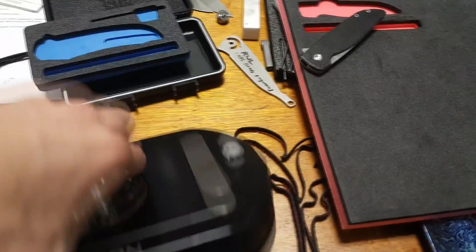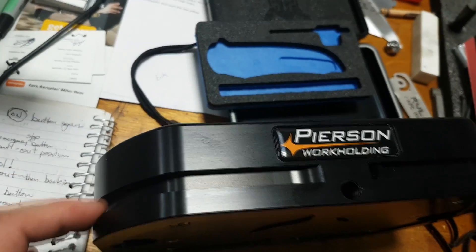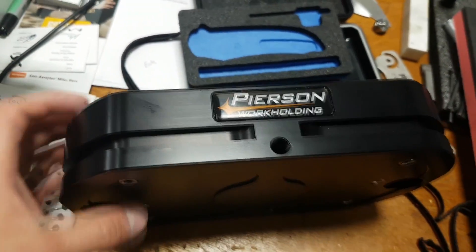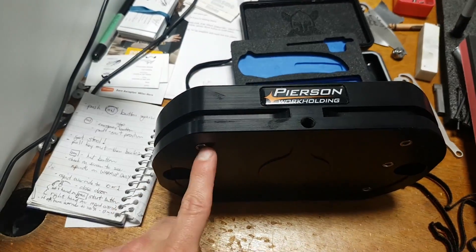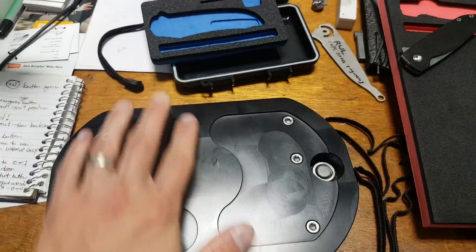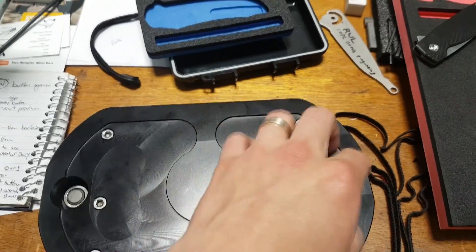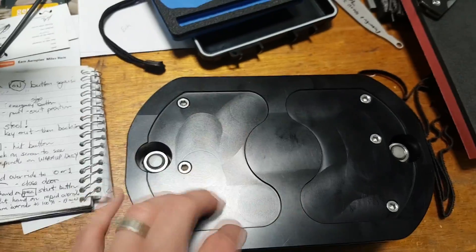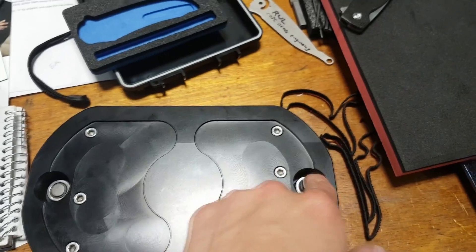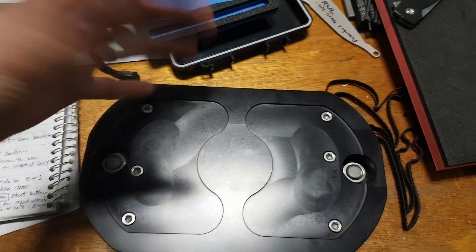He even makes the bed clamps with some sweet machine toolpaths on it — I'm a sucker for toolpaths. They make their own hardened pins here. I love the logo, I love the detail around it. Even both sides of this has a chamfer. This is made out of one solid piece of aluminum, with the hardened stainless steel plates screwed in from the bottom — love it. Love the contrasting toolpaths on the bottom. They did a nice slow facing pass for the main surface, and then for the kind of lightweight pockets it goes faster — a really cool mashup. The fixture pins are nutted in from the bottom, just a very, very secure setup.